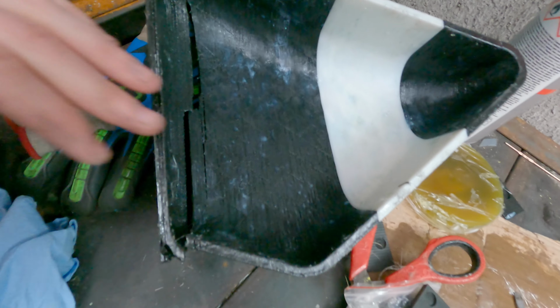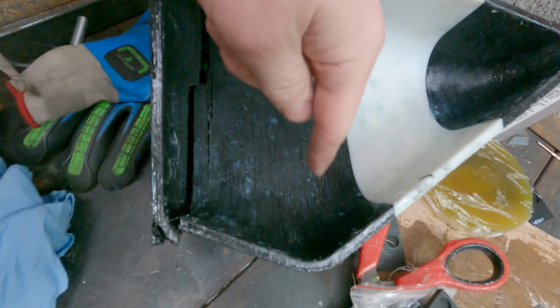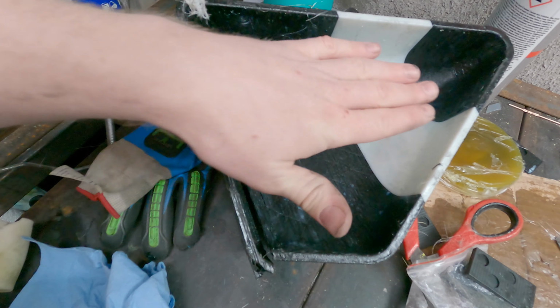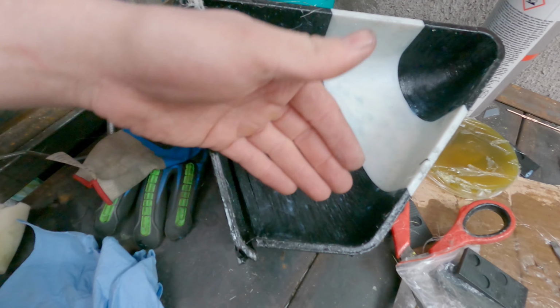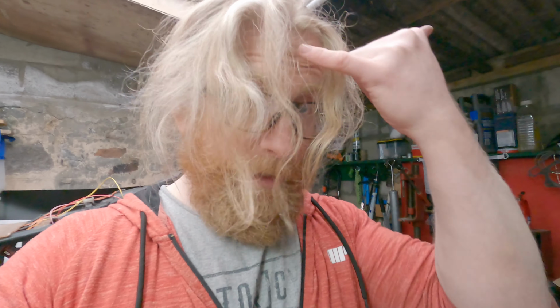However, I was having my doubts about the integrity of the mould. You're meant to print it in a way that the lines allow you to release it. So if you had gone horizontal, it's quite a difficult shape, but my theory being the lines going this way, it's not going to bite. If I printed it with the lines stacked up the other way, it might have got even more stuck. But I think the layer height probably didn't help me. It probably added a bit of resistance.